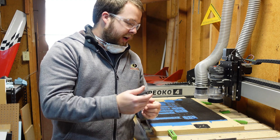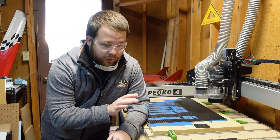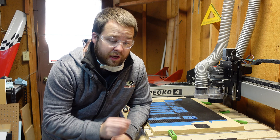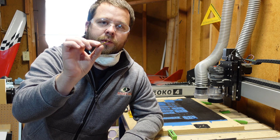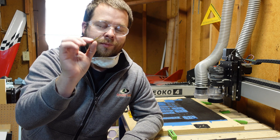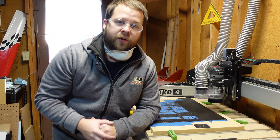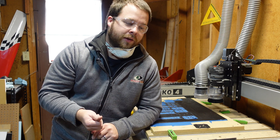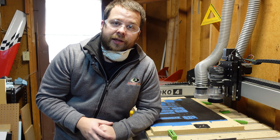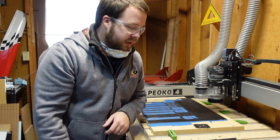That's the process of cutting carbon — at least my workflow. I've found the correct bits after wasting a lot of money. These Amazon special burr bits are the best for the money, and China manufacturers use the same stuff. You can usually get about half a sheet — this is a 400 by 500 millimeter sheet — before a bit starts to degrade in performance. You'll start seeing more fraying and more dust as you dull it down.